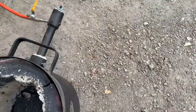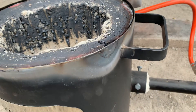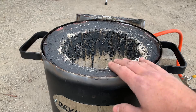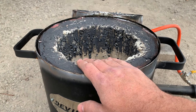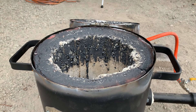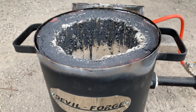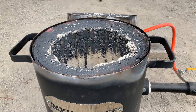To help preserve this — like you can see on this side, it's starting to do some damage to the wall of the forge — I want to try to preserve this as long as I can. You see a lot of heat scorching up here. I wonder if that's because the wool has sort of shrunk down up here at the top, and it might be about time to replace the wool all the way around. For all of you who have forges similar to this, I wouldn't mind hearing your perspective as I make the plan to fix my forge. I really love having this forge and I want it to last as long as I possibly can — they're not cheap, so I'd rather not go out and buy or make a new one.